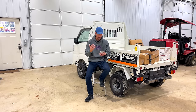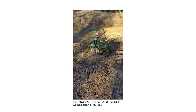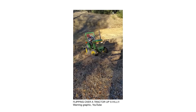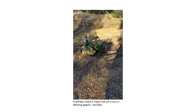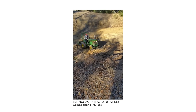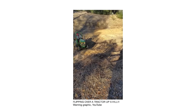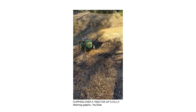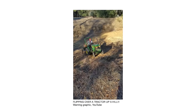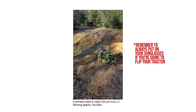This video was a bit of clickbait because it says flipping over a tractor up a hill. This gentleman did not flip, fortunately, but watching this you can see how repeatedly his front tires come off the ground — he's going straight up a hill. There's a chance he has a box blade on the back of his machine, and if things went well, that box blade would kind of top out on the three-point and not let him flip any further back — kind of like how the backhoe frame did on a previous video we showed you that stopped and prevented the tractor from flipping further backwards. Nonetheless, I would never be doing this with my tractor. I would back up this hill, and that's a recommended practice. Make sure you're in four-wheel drive if you have that available, because that will give you power to the front axle, give you stopping power too, and make it a lot safer to operate.